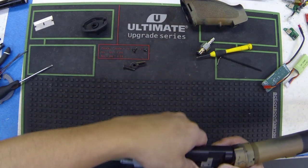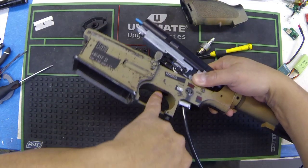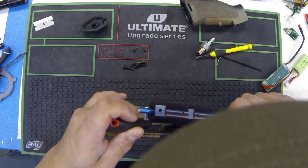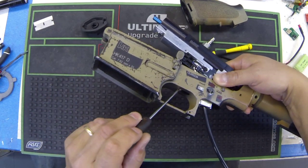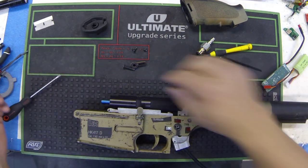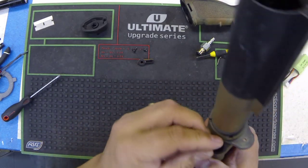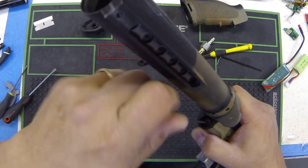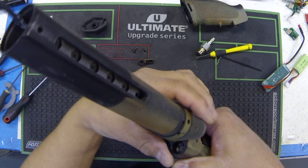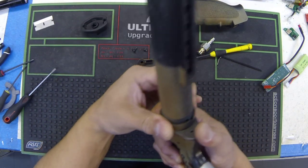Alright, you hold the selector plate and it sort of partially slides in. Now at this point, you have to get the trigger to fit into this trigger hole here. So it helps just use a small screwdriver. You push the trigger in and it'll clear into that hole, and once that's clear, it drops right in. There you go. Now we just replace the rear screw that locks it in place. Let's tighten that back up. Again, hand tight, don't over torque anything. And we'll tighten this down here at the very end. I'm just going to do that partially.